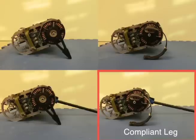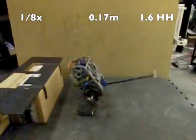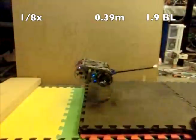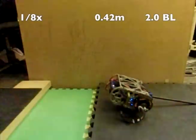Lastly, we build on the previous behaviors by selecting an initial leap with minimal body pitch and high apex energy to prepare a second springy step, storing and recovering energy from the first step using the leg spring. With this strategy, we get dramatically improved performance.